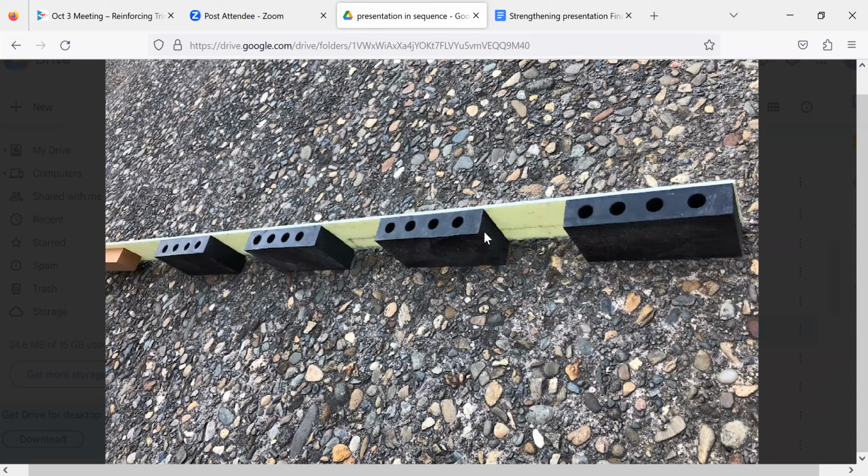Question, how did you glue it to the G10 piece here? They're screwed in with small screws from the back. The screws extend maybe a quarter inch into the rubber. I see. Does the rubber not bind on the case? No, it's all fitted just right, so the dagger slides really nicely down there. The rubber does not need to be as wide as the case. The rubber is intended to be at least a quarter inch narrower than the case.